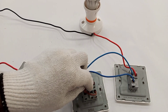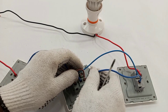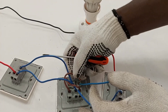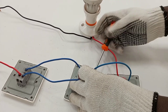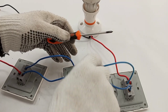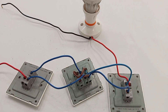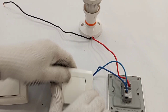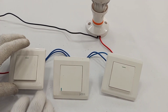After bridging, we are left with L1 and L2 to connect the strappers from the first two-way switch, and L21 and L22 for the strappers from the second two-way switch. Connect the strappers accordingly: this one to L2, this one to L1, this one to L22, and this one to L21.